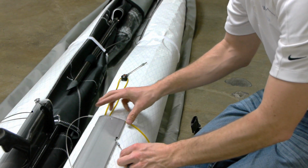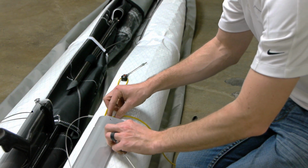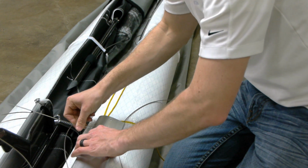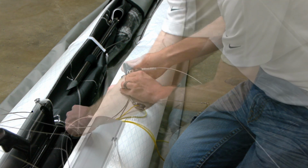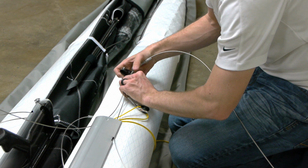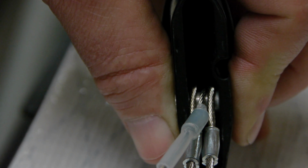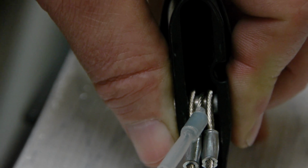At the other end of the down tube, install the front and rear wires and VG system into the bottom down tube plug. The bushing that you removed earlier holds all of these pieces in place. Make absolutely sure that the bushing has captured all of these pieces.